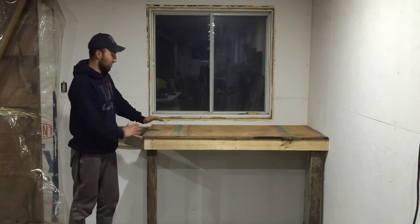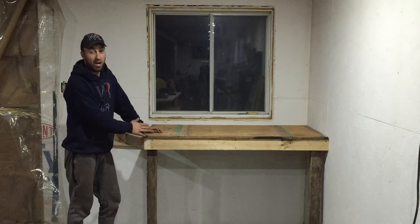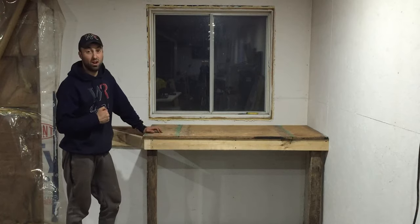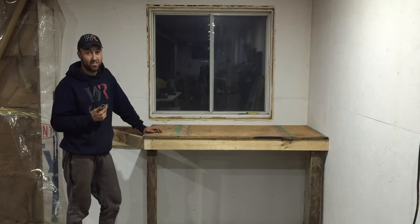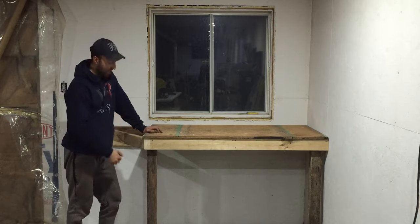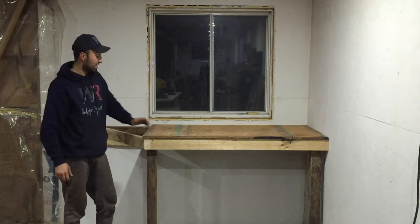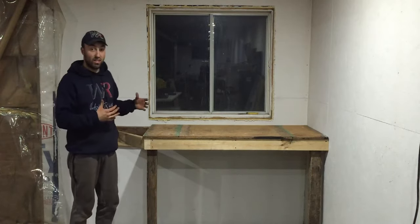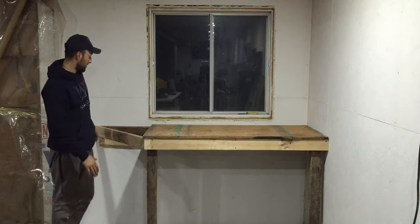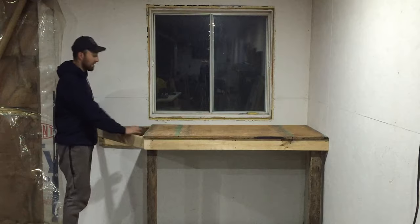The piece of plywood is on top of the workbench frame right here. 3/4 inch plywood will make your bench really solid. If you want to bang on this table with hammers or anything else, I would suggest going a little bit thicker — maybe 1 inch — and possibly putting another leg down there to make it even more robust. For my purpose, this is good enough. Now I can cut out a little triangle of 3/4 inch plywood and mount it right here.